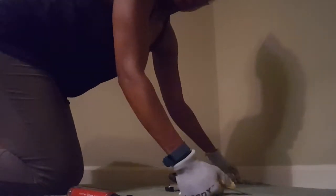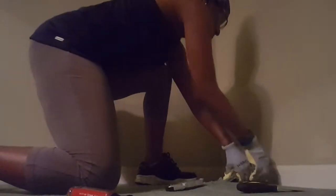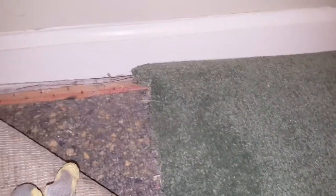All right, got a little piece up here - put our back into it. So here is this lovely green carpet that I'm pulling up. Here is the piece I got - that's the tack strip. The carpet padding is stapled, but all along the edge, the perimeter of the room, this carpet has these little upside-down nails and they essentially hold it in place. So you want to find an entry point and then we're going to start pulling all the way.